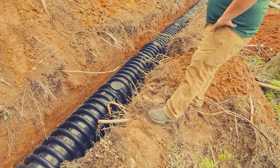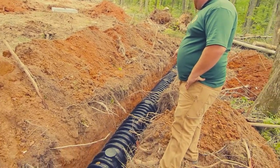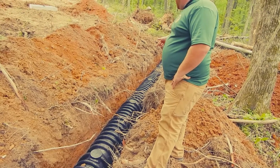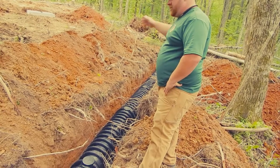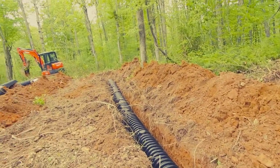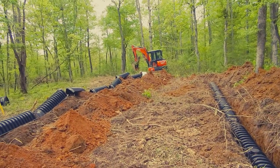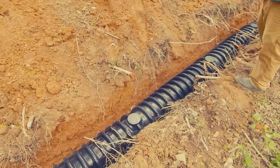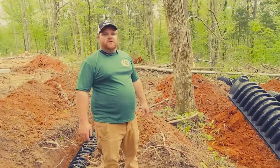So these are infiltrators. How are you going to hook these up? We'll come straight out of that tank with three-inch PVC, go right into the top of these domes, take a hole saw bit, cut right into it. We're going to take a straight elbow, pop it right in, make that all hooked up. Then we'll come over to the very end of this, make another crossover going from this ditch to that ditch — to the second ditch. We'll do the same thing: take a hole saw bit, drill into this one, and drill right into the top of that one, and hook it up. And there you have it, folks — that's from Mr. Booth himself.